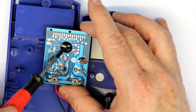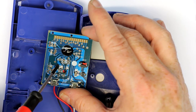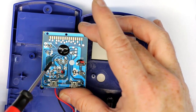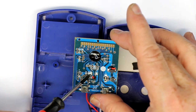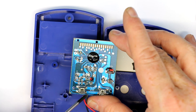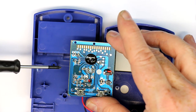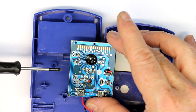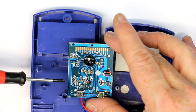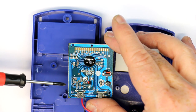microcontroller with probably an integrated op-amp, because the thermal voltages here from the red and the black wire are so low, and they are going here only through two resistors, a few decoupling capacitors, and then the thermal voltage goes directly in below the blob. So either they have also an additional op-amp under the blob, or there's a microcontroller that can really handle extremely low voltages with an inbuilt amplifier. Could be the case, but again, quite interesting how few parts the Chinese need to make a perfectly working nice little addition to your lab.